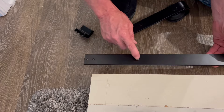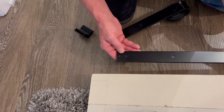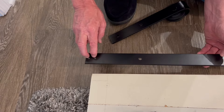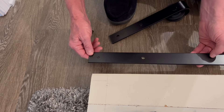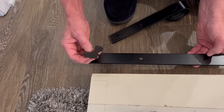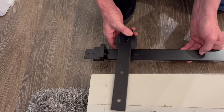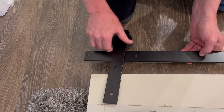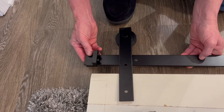In addition to knowing the installation height, we need to know where the track goes on the wall horizontally. Disregard the two end holes — those are used if you're connecting two tracks together. This is a 72-inch track, which is the minimum needed for a 36-inch door. Most barn doors come with a bumper mechanism that slides on with allen screws, so when the door is hanging it bumps against this and can't roll off the end of the track.